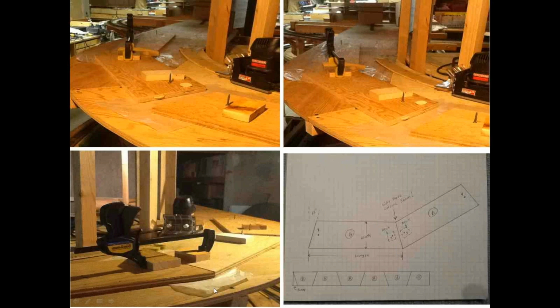And then I put a screw in hole number 1. Actually, sorry, back that up. First thing you do is put a light layer of glue on each side, including filling the pocket for your biscuits. Then you screw down screw number 1 on top of your board with your wax paper in place. Then you set piece B in place, line them up a little bit, and put your clamps on very slightly.